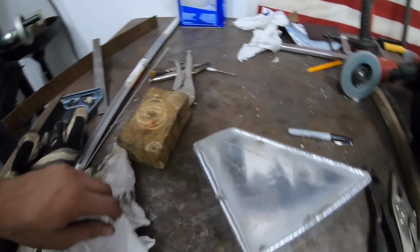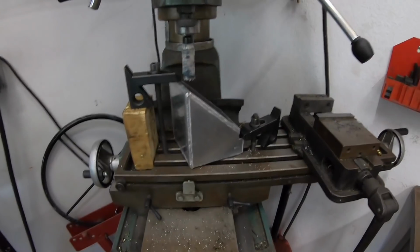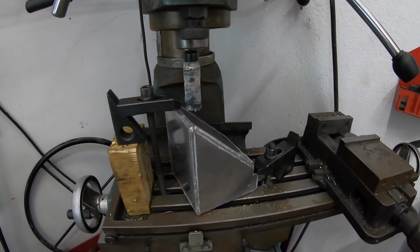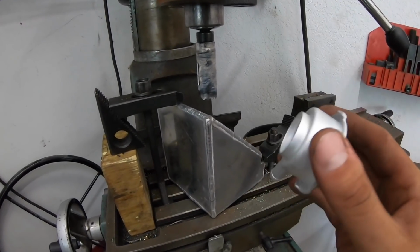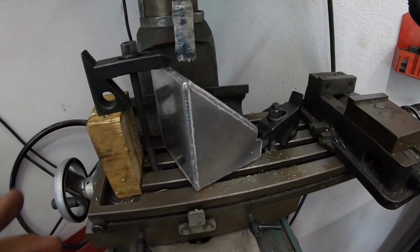Well, there we have it. Nothing fancy. All right, check out what we got going on. I got our expansion tank welded up. Made a mistake. James actually pointed it out. This should have been welded first from the inside. So dummy me, but whatever. We'll weld it from the outside. It's just not gonna look as clean. But whatever, that's all good.